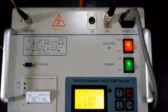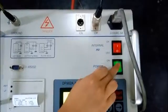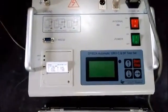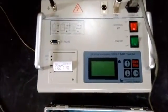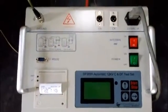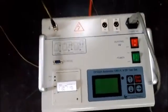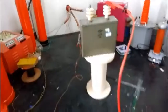Now let's use the GST test mode. First, switch off the power supply and the internal high-voltage output, and change the connection. Connect the low-voltage terminal to the grounding socket. Now all the wires are connected well.